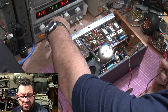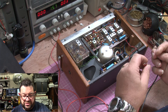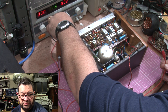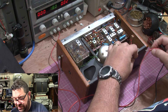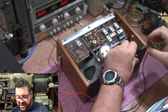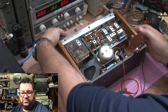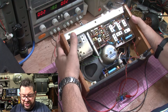It's set to 200 milliamps — good enough. Let's check the voltage and take it up to 18 volts. So 18 volts. We said negative this side — so negative lead is there, positive lead can go on that. And we are getting the working set there. I'm going to turn that up.